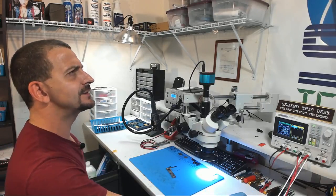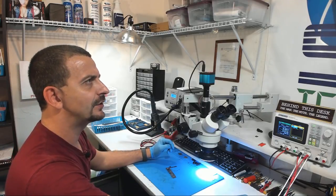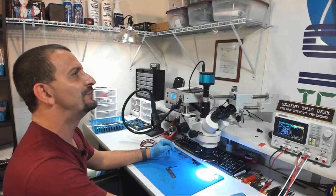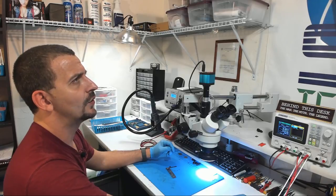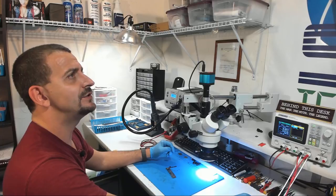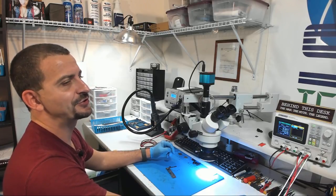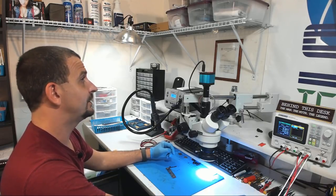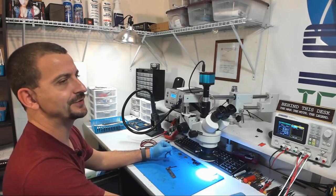It says, U1503, L1500, wait a minute, is this the beginning of the request? Holy cow, they actually started it out like that. Okay, U1503, L1500, L1519 and U1501 were cleared to resolve major shorts, was left with a 2-amp short pre-boot prompt, found that SDRAM was the culprit via thermal imaging. I need data recovered, photos, password. Oh wait, you don't need to know his password. He needs photos, all right?